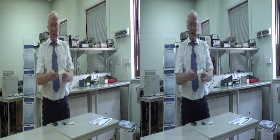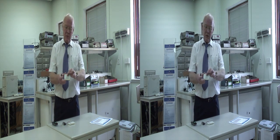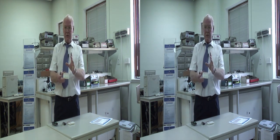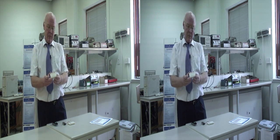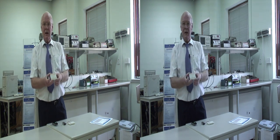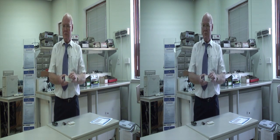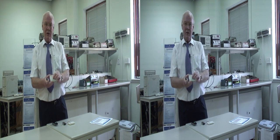There's one thing we've missed out: we said the LED — if you put a smaller value resistor, it will get brighter, and if you put a larger value resistor, it will get dimmer. So there's a happy medium that we need. Most LEDs will work from something like 6 milliamps up to 25 milliamps, but the life of the LED goes down as you take more current.